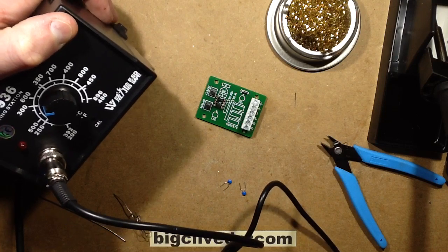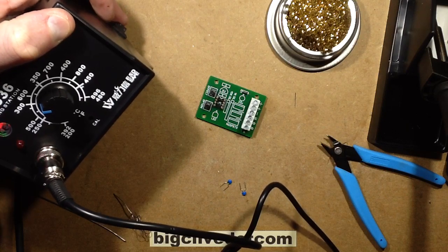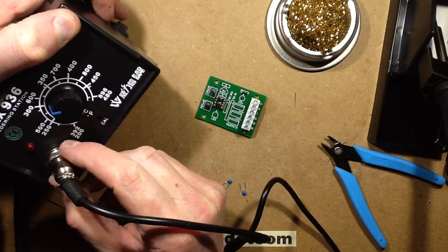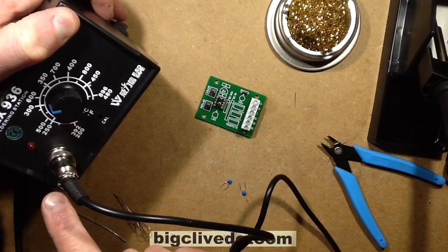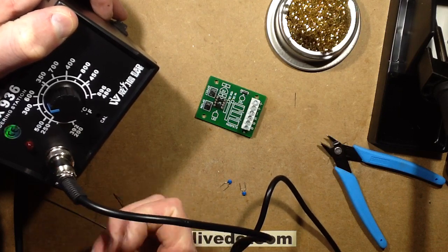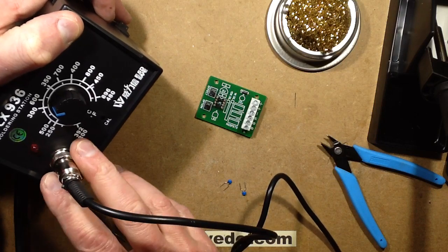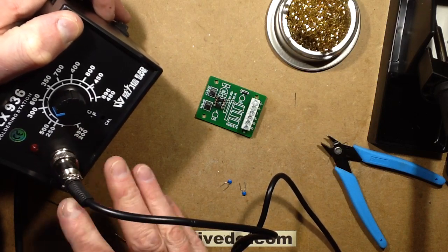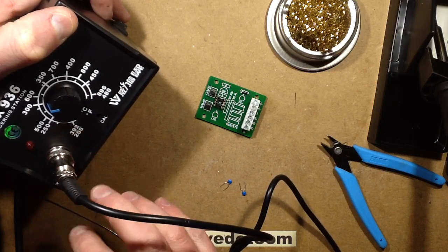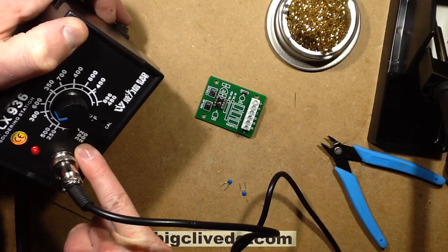The only place it falls down is in really high mass solder joints, but then most soldering irons do. That was demonstrated by trying to get the back off this connector, where there were just so many big pins taking the heat away through a double-sided board, which made it somewhat more complicated. I've tried to clean the solder off, but that just makes it a wee bit harder.